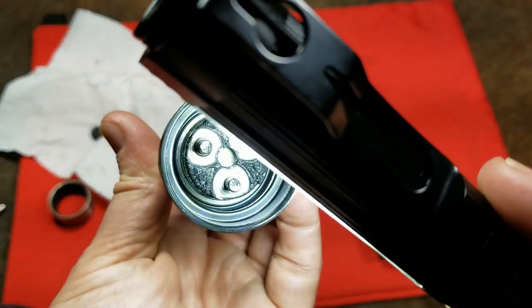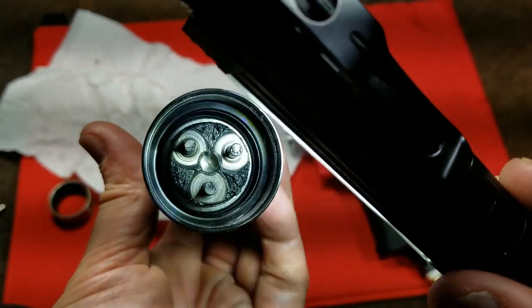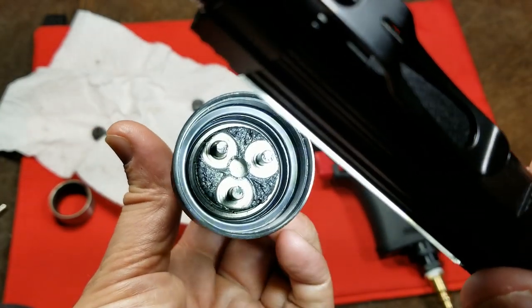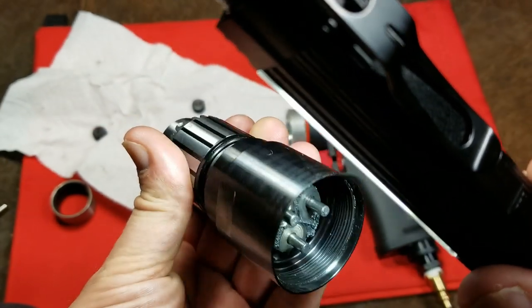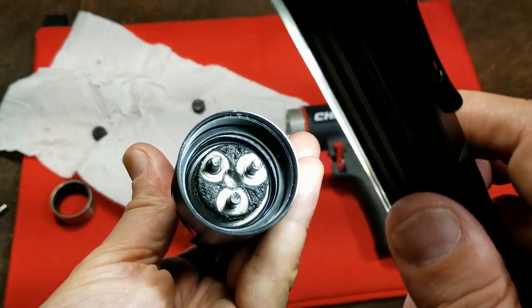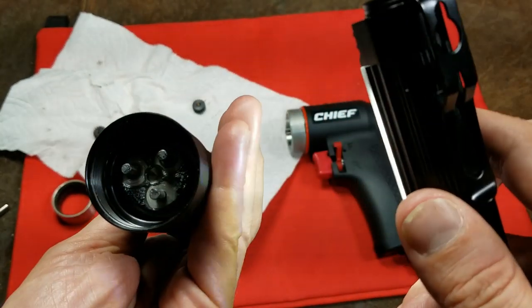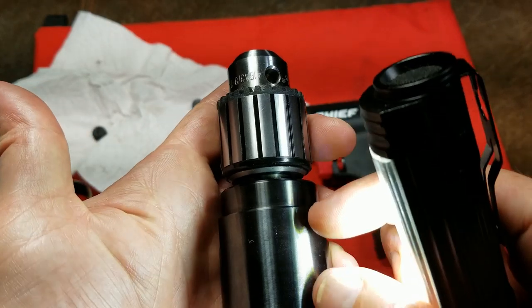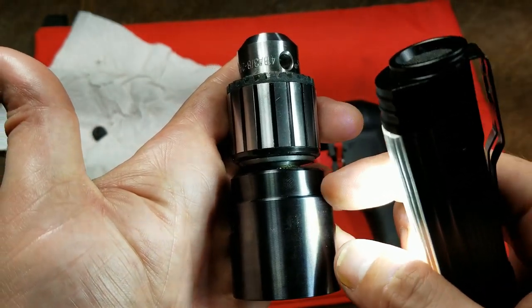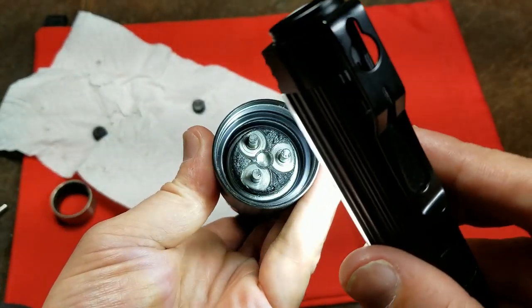In the back it does have three planetary gears. There's the back of the first ball bearing in the steel housing. The engineering is pretty nice — it's a pretty large bearing, about one-and-a-quarter inch in diameter. There's a little separator rod, a small space between the bearings, and then a second bearing up front. So that's really nice to see — pretty heavy duty.